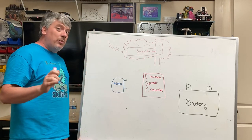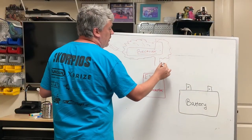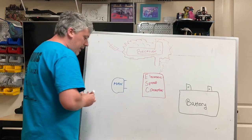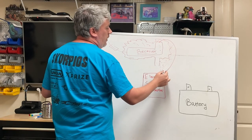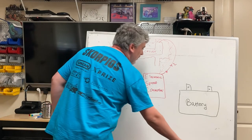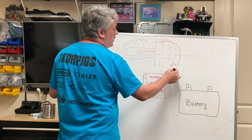The receiver is only hooked up to a single piece in your robot through a three-wire bundle. The yellow wire is the signal wire — this is where all the instructions come from the receiver to the heart. Then it has a red wire, which is the positive, and this is where the heart, the electronic speed controller, sends positive voltage to power the brain, aka our receiver. The last wire is always brown or black, which is the negative wire, and that's where used voltage comes back.